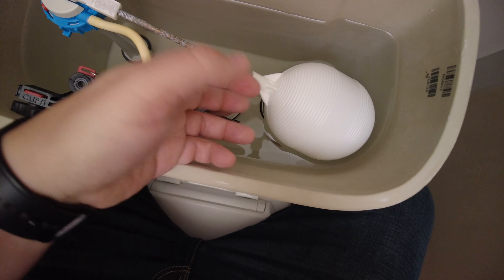To remove the flapper, undo the chain from the flush handle, then unclip the flapper below — these just clip on to the sides, and the whole thing comes out. By far, this is the easiest thing to replace if it happens to be faulty. If you notice the flapper is deteriorated, has cracks in it, or looks like there are chunks peeling away, then most likely this is what's leaking and it needs to be replaced. Note that flappers come in two different sizes — typically two inch, which is the most common, but there are also three inch flappers. You need to know what size your toilet uses before you purchase a new flapper or a complete kit.